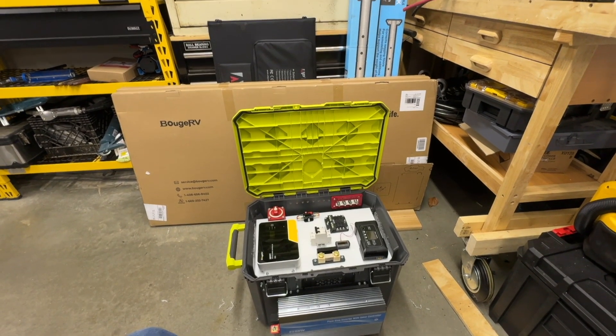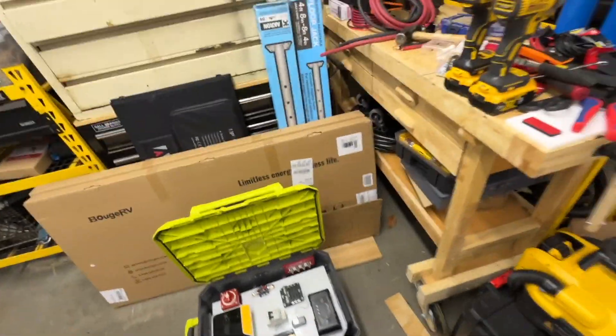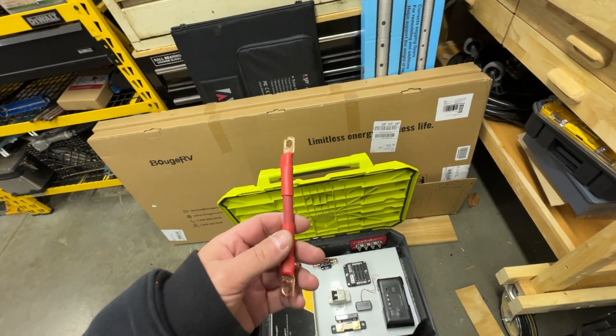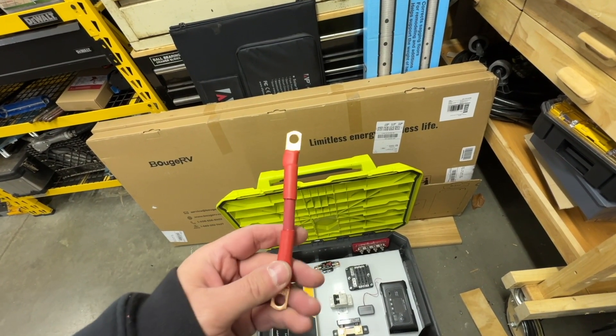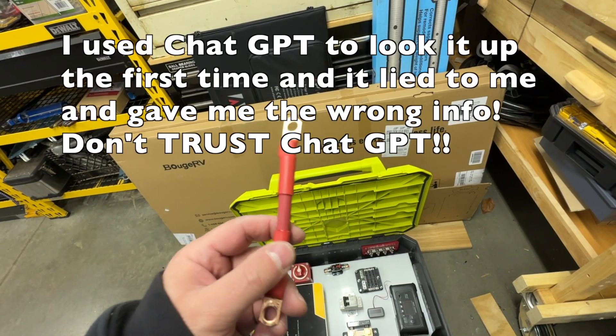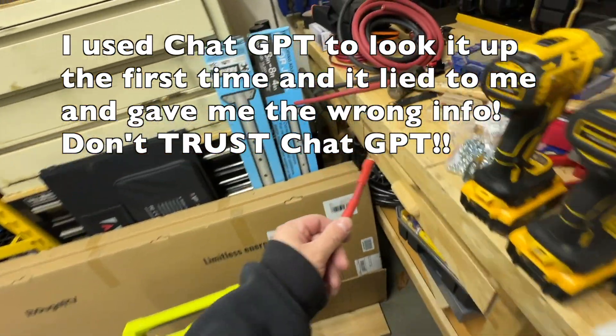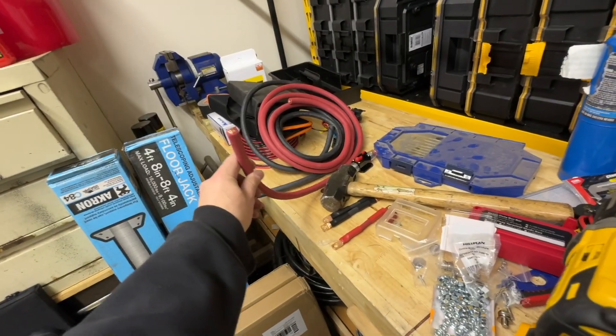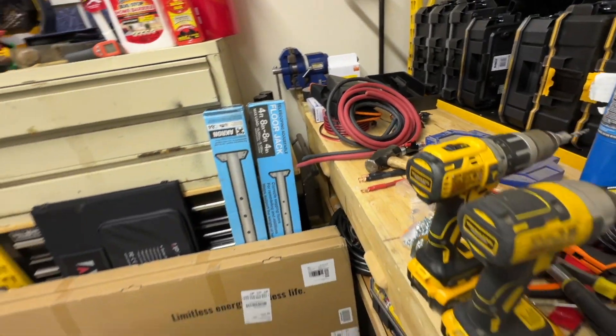You've got to research your cable capacity. I started out using 4-gauge wire, and when I looked it up again I realized 4-gauge is not sufficient to handle up to 100 amps. I had to upgrade to 1-ought wire, which meant ordering more ring terminals — there's just a lot to it all.